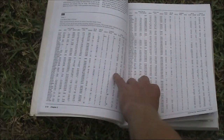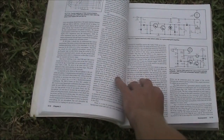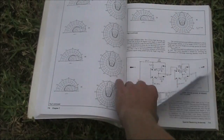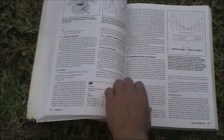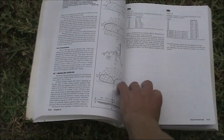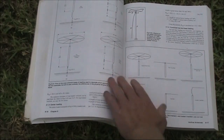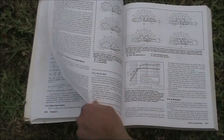But if you want to really get the best out of your amateur station on the lower HF bands, then this book is a classic. It also helps if you have a lot of land, as some of the antennas here are quite large, and helps if you've got a big budget. But even so, even if you operate portable, there's a lot of good material in here worth reading. It talks about receiving antennas — that's really important on the lower HF bands — beverages, dipole antennas. Basically a dipole needs to be high — above half wavelength — to work on DX. Vertical antennas are very commonly used for DX; they have a low angle of radiation, but only if you've got a good ground, so there's a lot of attention given to radial systems and counterpoises in this book.